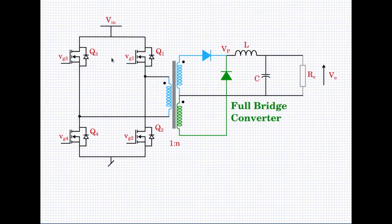During the period when all switches are off, the inductor will freewheel, as discussed for the push-pull case — half the current going into the blue winding and the other half into the green winding, in opposite magnetic sense, so the MMFs cancel and the voltage is zero because dΦ/dt is zero. During that time, the other end is at VIN, so the voltages across the switches are VIN. When Q3 and Q2 are on, Q1 and Q4 must withstand VIN. All switch voltage ratings must be greater than VIN.